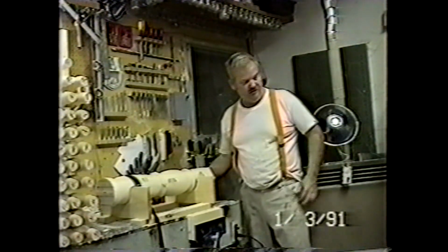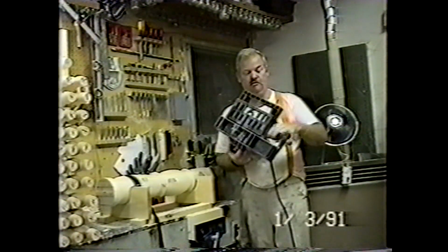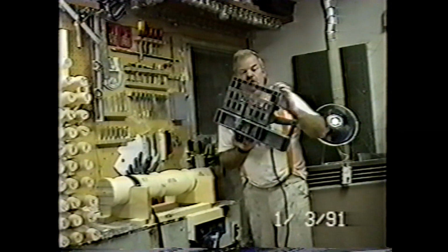Then I'm going to take this little gizmo here, you've seen earlier in the tape, the mill works. In the bottom here, in the router, I got mounted a dovetail bit, 7/16 dovetail. You see how this thing works a little better now with the router on here. See the flat edge of the work goes up against the fence here, and when you plunge it, out comes the router, zippo, and makes your cut.